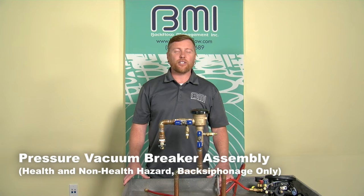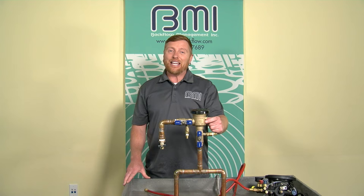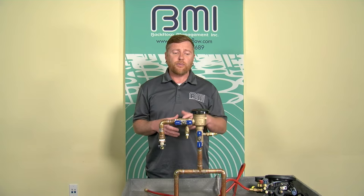The next demonstration is the field test of the pressure vacuum breaker assembly. During this test, our two evaluations are of the air inlet opening — the air inlet shall open before the pressure beneath it is less than one PSI — and then we evaluate a check valve, similar to the double check, making sure it closes drip tight against at least one PSI. As usual, I'd notify, identify, inspect, and observe. Then we remove the canopy to properly evaluate the air inlet opening.